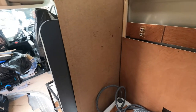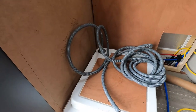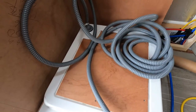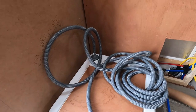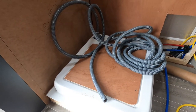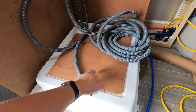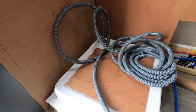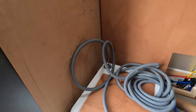I've prepared my first side panel which I'm going to be cutting out now. I've also prepared the shower tray in advance with the flexi pipe and waste trap fitted in the corner - upside down at the moment. I don't need anywhere near as much pipe yet but I'm reluctant to cut it until I've shoved it through the hole. As is always the case with these shower trays, they have a little recess underneath, so like everyone else I've Sikaflex'd a piece of ply into that gap to stop the flexing and bouncing.